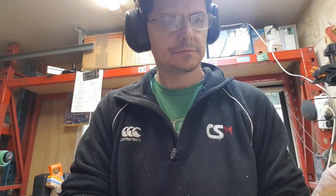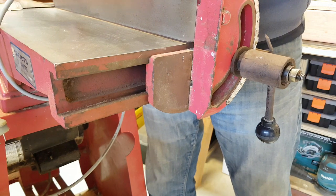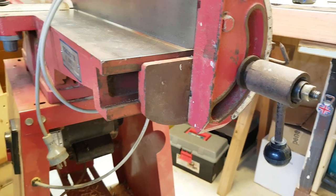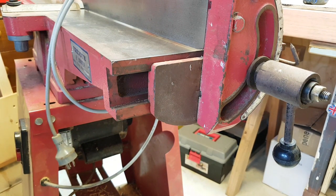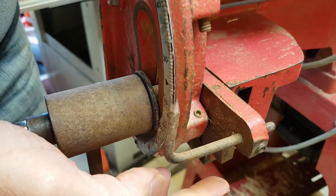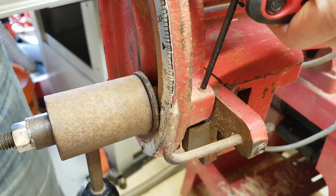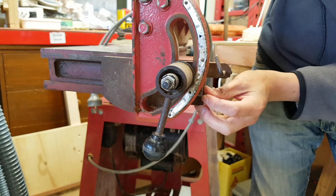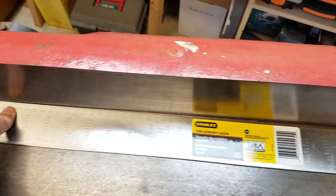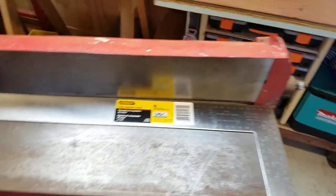Looking pretty good indeed. Very nice. Until you actually have one in your hands it's difficult to notice details like this, but the fence on this model attaches to this big T-slot at the end of the infeed table. If I'm not mistaken, most modern designs have the fence attached in the middle between the two tables. These inaccuracies in the fence angle can be corrected with these grub screws at the back, and you've got them at 90 and 45 degree positive stops. I noticed after fine tuning however that whenever I tighten down the fence it goes slightly off 90 degrees — something maybe to do with the age of it being a little bit worn out, but I'll need to check it out. Another really weird thing when I tighten it up is that the fence goes out a straight — I don't know if that's by design or by accident. It doesn't seem to make a difference to any of the cuts that I've made, but...